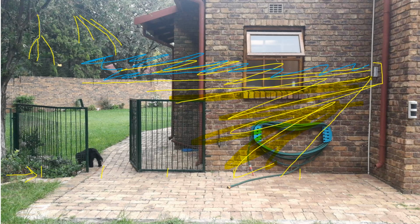This installation was designed during the day, and what the installers didn't realize is that at night, with temperature changes, this detection zone actually shifts. Secondly, what about rain? When it rains, these leaves actually drop down. So if this is the canopy of the plant, when it rains, the leaves become heavier and it drops to about that. So the branches lower themselves because of the weight of the water, and guess what? False alarm. So this actually happened, and therefore you have to derate foliage and things like that because of movement owing to wind or rain. So in the case of this tree, these little branches here, yes, they did set off this optics sensor.